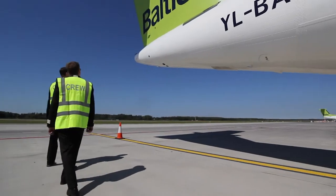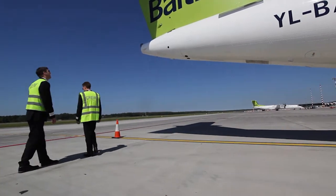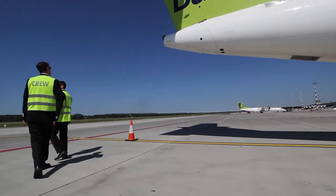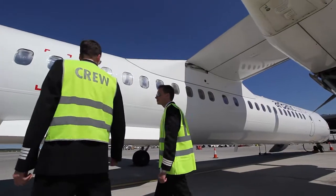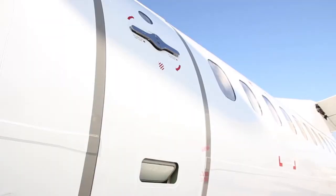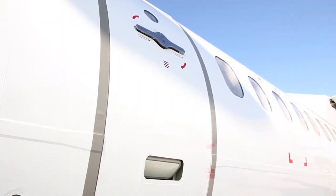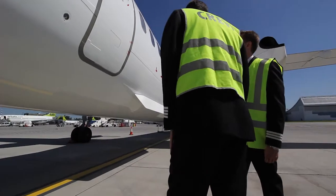Here we are Martin in the aft fuselage section. This section includes the tail empennage and goes around to the left wing. First we come to the right service door. If it's not in use, you can check the security of the lock by pushing in on the vent. If it pushes in, the handles will pop out and it means the door was not properly secure — maybe because the cabin crew wanted to vent the rear galley.